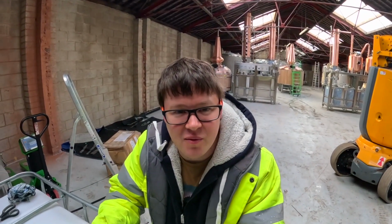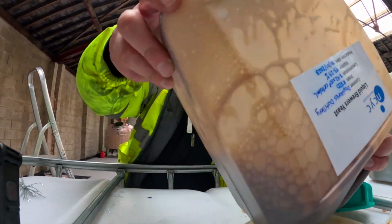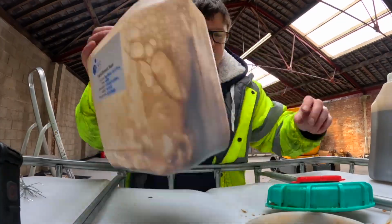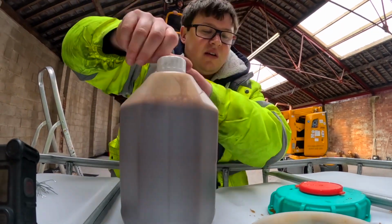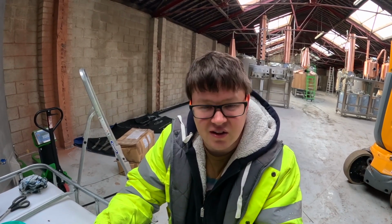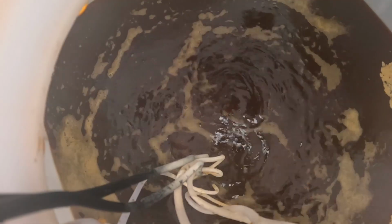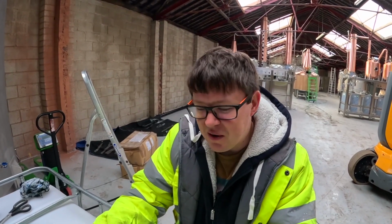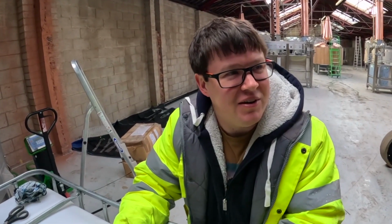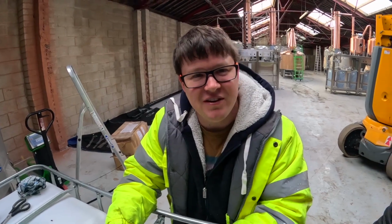We've got our own wet culture of what was once wild yeast. It's 3 strains of yeast that live together in a sort of symbiotic relationship, and when the yeast bank tried to separate them, they get very upset. But we've got to culture it up so it's big enough for us to ferment with. So what I've got going on here is 600 litres of molasses that's been diluted down, and now we're aerating it and keeping it warm with some fish tank heaters and fish tank pumps, and hopefully growing some yeast. All the yeast people are being like, that's not how you do it. I know long term this is not how you would do it, but just to get off the ground, this is how we're doing it.